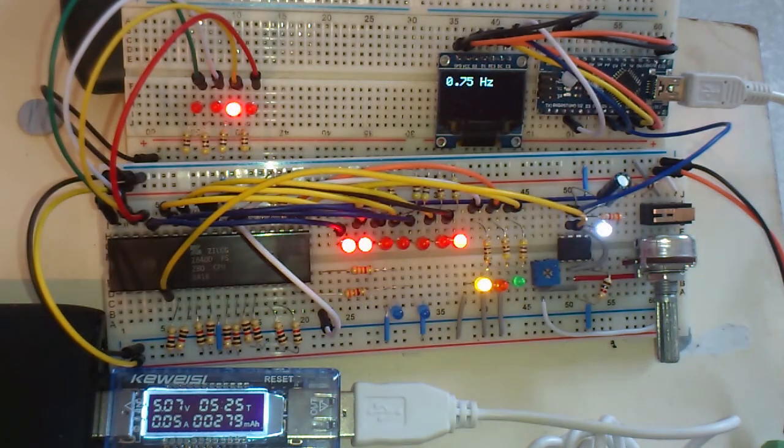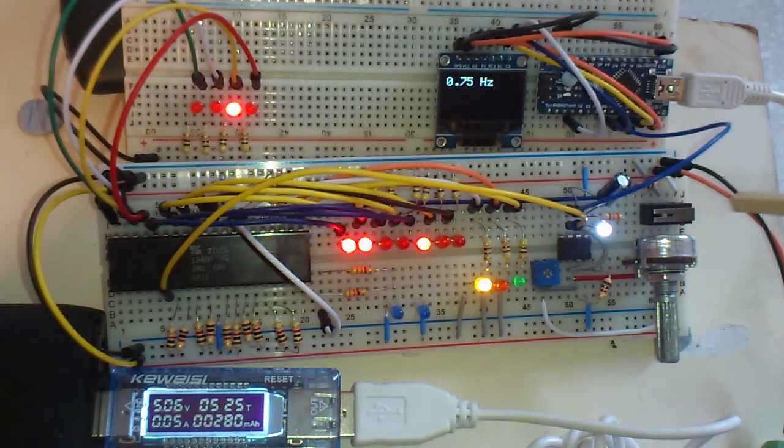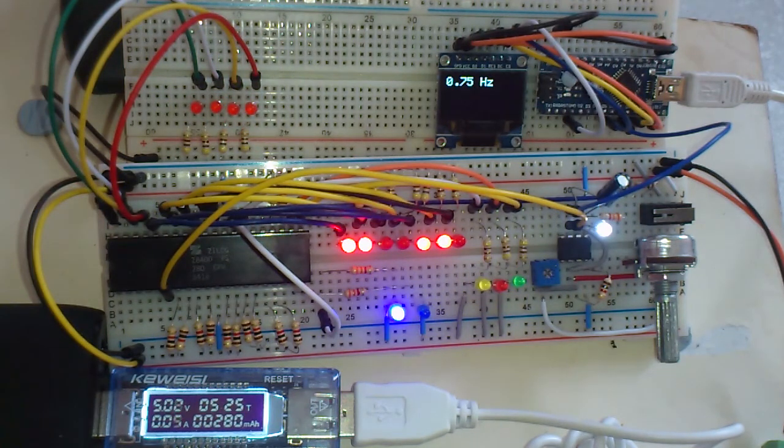You can investigate some of the more complicated instructions, accessing memory addresses and doing addition, and you might want to look at various outputs without the CPU automatically stepping through. You would just have a little switch to step through. And as I say, the older NMOS technology CPUs aren't guaranteed to be stable, but this one seems to be. The ones I use tested all seem stable down to about 1 Hertz anyway.